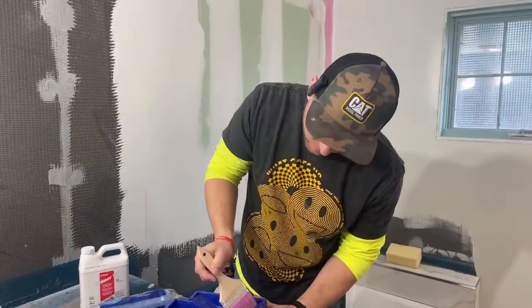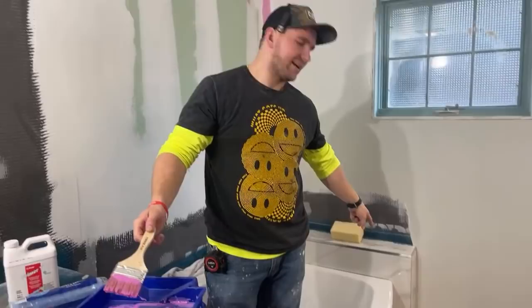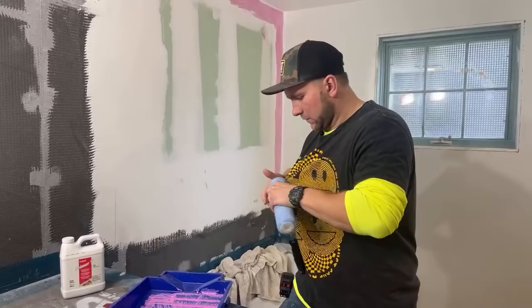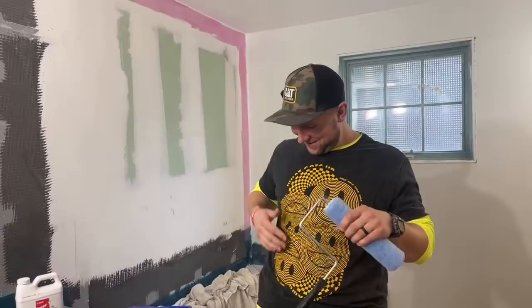This is not a high traffic area. If you were to do a curb, you should probably do epoxy. But if it's a curb, I don't do those. I used to, but it's just too brittle, I think. So if you have a curb, I just use Schluter strips because I think they're just stronger, or ideally you just have a nice sill piece. So in a non-high traffic area where you're just putting shampoo bottles, you're not going to ding it. I hope that makes sense.